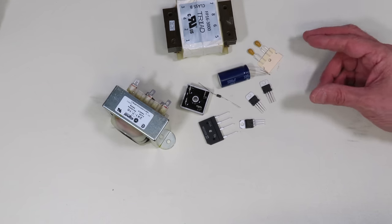The circuit for the negative regulator is very similar to the positive one — power transformer going to a bridge rectifier with a filter capacitor. Note that the hookup to the regulator is different and the ground side is on the positive side, not the negative side, because we're looking for a negative output. The same considerations apply for filter capacitors. I used 1000 microfarads for the filter capacitor and 2.2 microfarads for the output capacitor. If you're using polarized capacitors, make certain the polarity is correct.